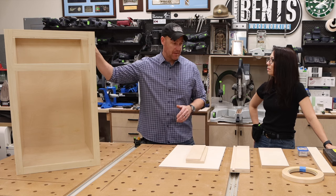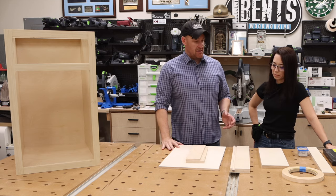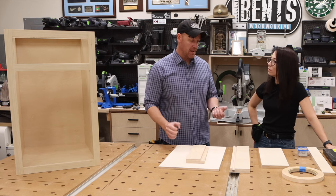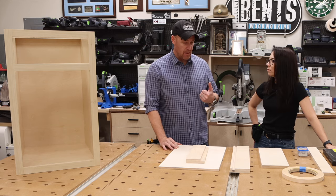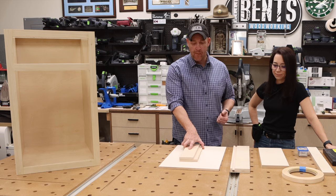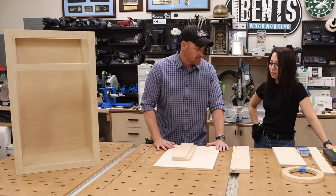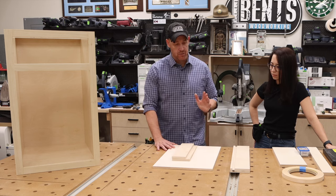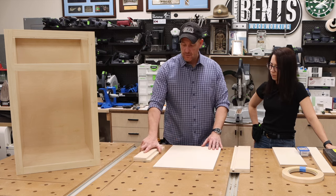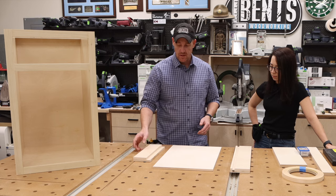The slides are going to be 21 inches in depth because it's a 24-inch cabinet, so we want to maximize the space. This is a little bit more technical because there are a lot of small things to keep in mind and a lot of measurements. To start out, we need to build the drawer box. The way you construct a drawer box for undermount slides is pretty specific — it comes with five parts.